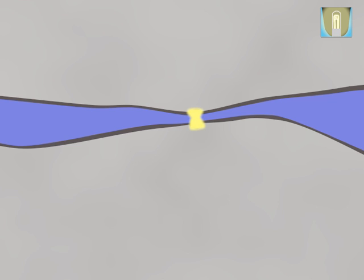What is now happening is basically the same that happens when the hot filament of a light bulb is exposed to air. It burns out. The contact bridge is so hot that it starts to vaporize. Because the contact bridge is not pure metal but contaminated with oxides and other material, there are spots in the bridge where relatively little conducting metal is present. These spots heat up even more, and the heat causes them to vaporize even faster. This vicious cycle gets even worse because the hot metal is exposed to air, so it is rapidly oxidizing. In the end, the hottest spot of the bridge explodes.